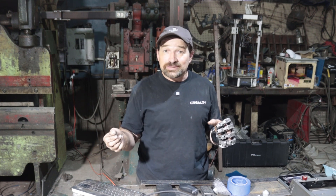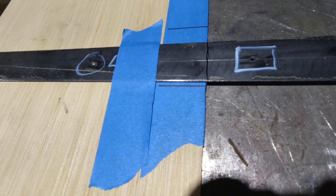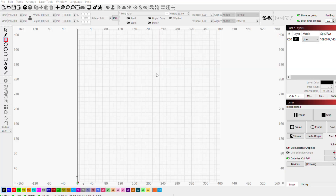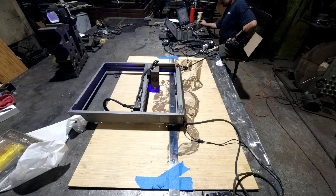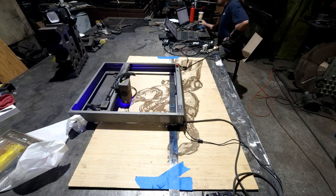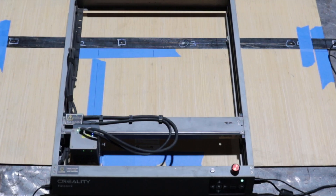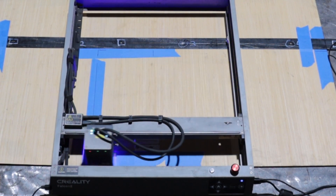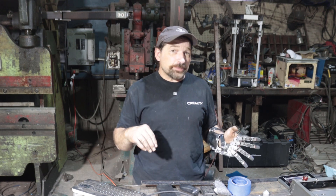Once I'm confident that I've repositioned the laser and flat bar correctly and I have 150 thousandths showing from the layout line to the bottom edge of the flat bar, I import the number two panel, home the machine, and press go. If I'm not confident that everything is positioned correctly, I'll take a moment and cut a scratch pass scribing the layout rectangle that I drew in Lightburn at the very beginning, setting it to cut at around 10,000 millimeters a minute at 15 to 20 percent power just to make sure everything lines up.